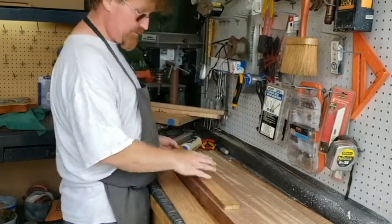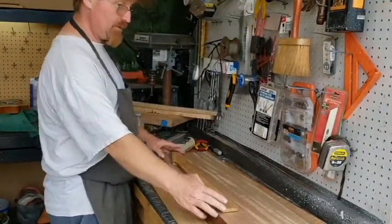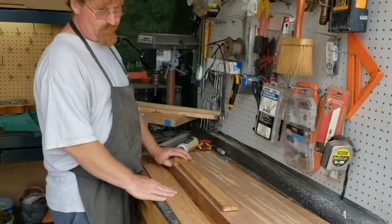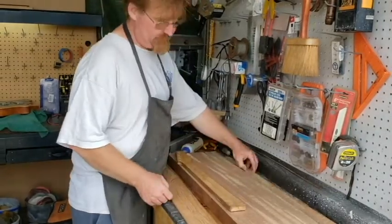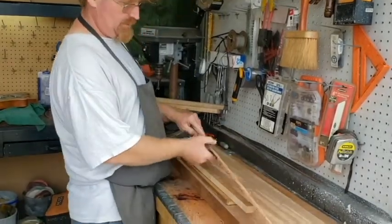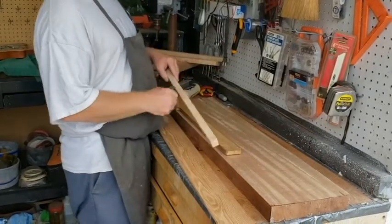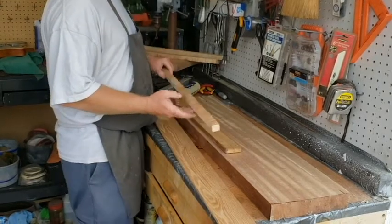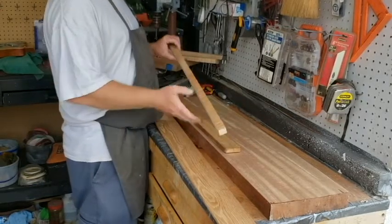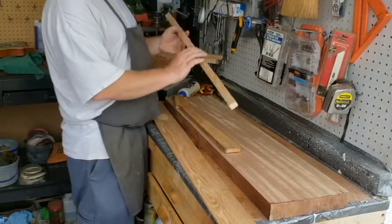Now, this is going to be a five-piece laminate. Normally I'd want the headstock and everything all out of one cut, and I'd trace the whole thing. This time I'm not doing that because we're going to do this as a five-piece — we're going to have maple in the middle and red oak on either side of that maple. The maple in the middle is almost the right size we want already, so I won't have to do a lot with it other than clean it up and make sure it's glueable.